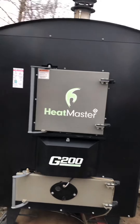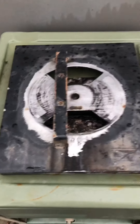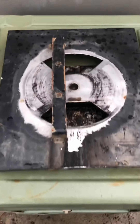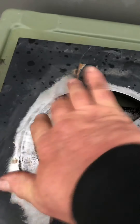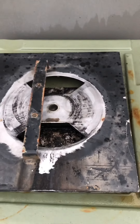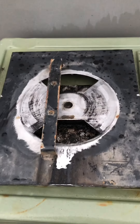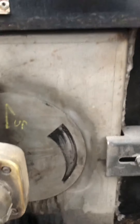When I first installed this one in 2017, it had the original airbox, which is this one square-cut quarter-inch plate on the face. I was cleaning that weekly — just planned on every Sunday, pop the damper motor off, hit it with a wire brush, get it all shiny, put a little transmission oil on, reassemble it. If you do it enough, it's not even a five-minute job. I had less time doing that than I would cleaning the stack on my old conventional so the creosote didn't plug the elbow up.